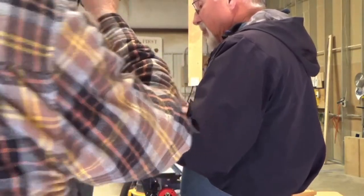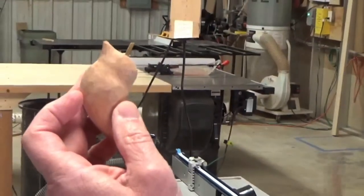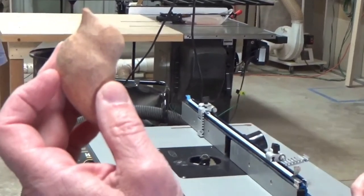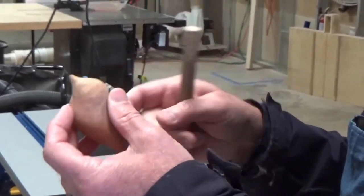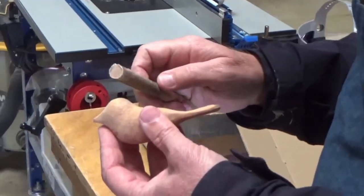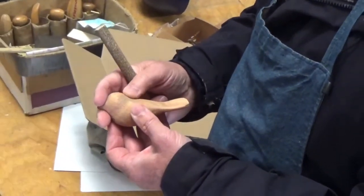You're going to leave some serious grooves with the 60 grit, but as you work a finer grit that's going to come out. I want to dig that out so it has more definition to the head. I need to take more out right here to have that head merge a little. In the back of the head I like a little more definition. In the original Frank Faust design — as you'll see on his profile, which I'll give you a copy of — he likes a very distinct, almost sharp edge back here where the bird comes down. I think though, when a person's holding it, it should be a smooth curve.